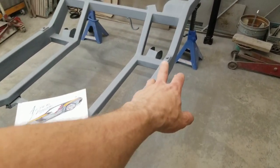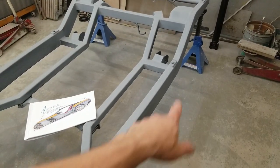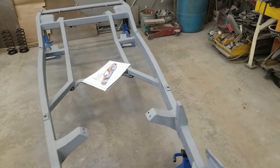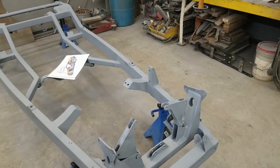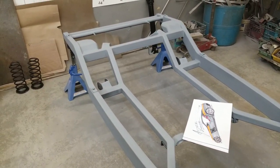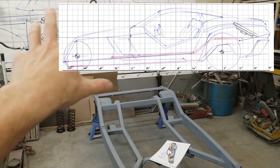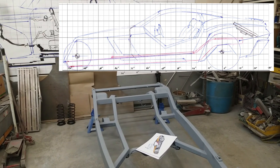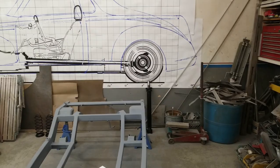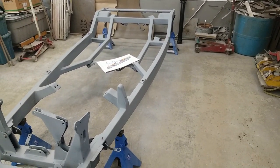To keep the front end nice and low and sleek, we're going to take the radiator and move it to the back — two coolant lines, one down each side, and the rad right there at the rear. Those plates are your cab mounts, or body mounts — three per side. If you want to remove the body, you pull those bolts and lift the body off the chassis. Today we're going to get the front engine installed, get the rear axle in, and perhaps get this up on a table. We also need that blueprint up on the wall to start the wireframe buck, but unfortunately the printer hasn't been in contact yet — there's been a bit of a paper shortage — so in the meantime we'll just start planning things out and getting the chassis set up.